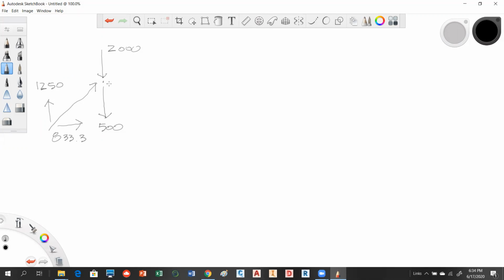So now we just need one more here. That's the member DC. DC is the unknown, and it's going to have two components. If we look at this, it's kind of easy to figure which way this is going, because if you notice, that plus that is greater than that. So this guy would have to bring a vertical component. So I'm going to say this guy is actually acting as a compression member. I'm going to call this DC. So let's see what happens.